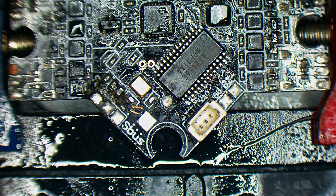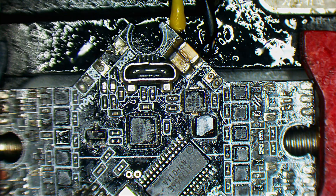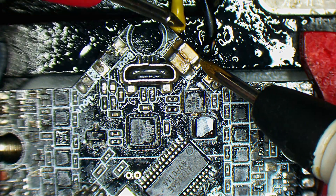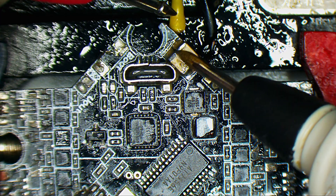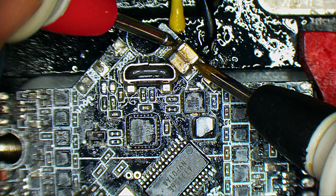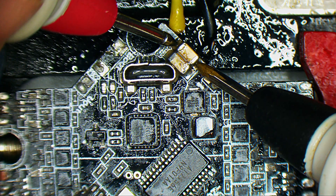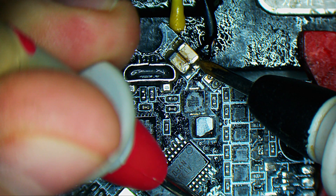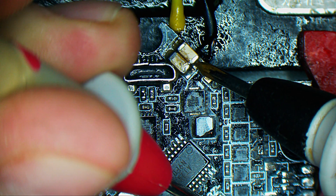But it doesn't work. Do we have some voltages on this board? Usually when you have issues like this, I'm going to suspect that because these two caps are laid out like this, this side will be the positive and this side will be the negative. And yep, I'm right — I have here 5V. But it's not 5V, it's 1.9V. That's quite fishy.